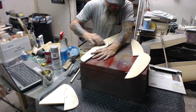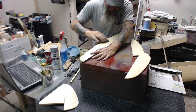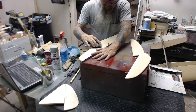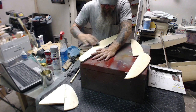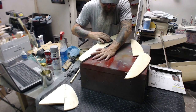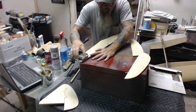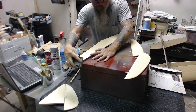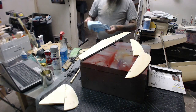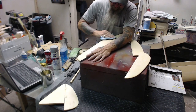My buddy at St. Louis Plating, I used to go down to his shop, and I'd watch those polishers, and they'd do the same thing we're doing here. They would sand, file, buff, shape the pieces of metal until they were absolutely 100% smooth and they looked like chrome before they went in the tank. And if you don't think so, just go down and ask your plater, can you go back there and watch for 10 minutes or whatever? And you'll find that's exactly what happens. That part is 100%. It looks like chrome before it hits the tank.